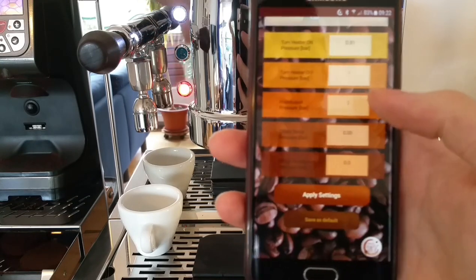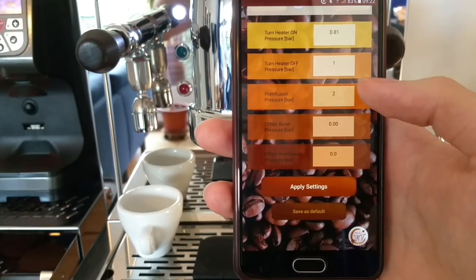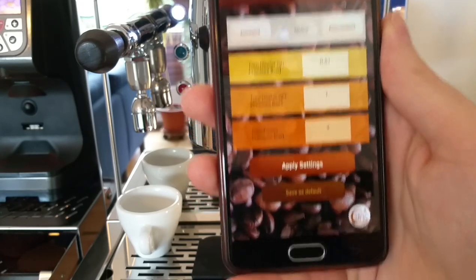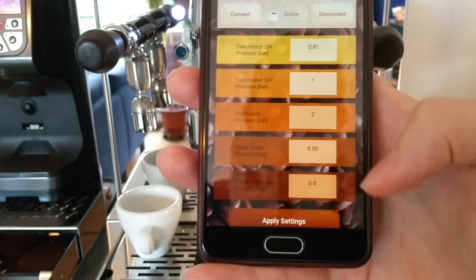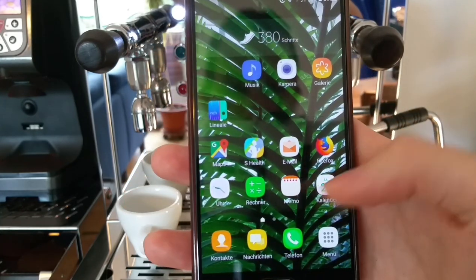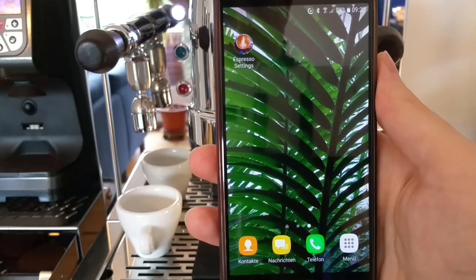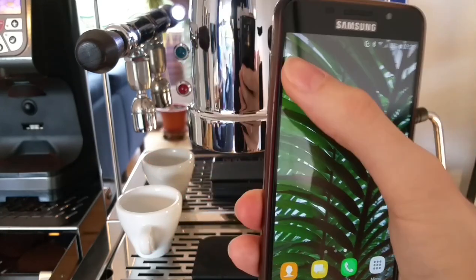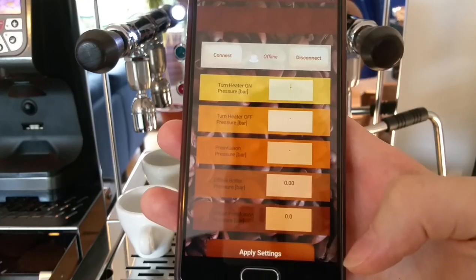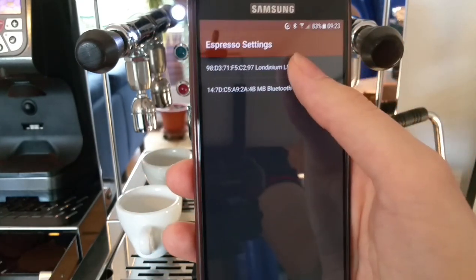These offsets can be set if you have a different sensor or the resistance isn't exactly matched — you might be off by part of a bar. You can set it so the value exactly matches the manometer. That's why I also added an option to hide all this. Click the logo and all your offsets will be hidden. It will stay hidden even if you close and reopen the app.